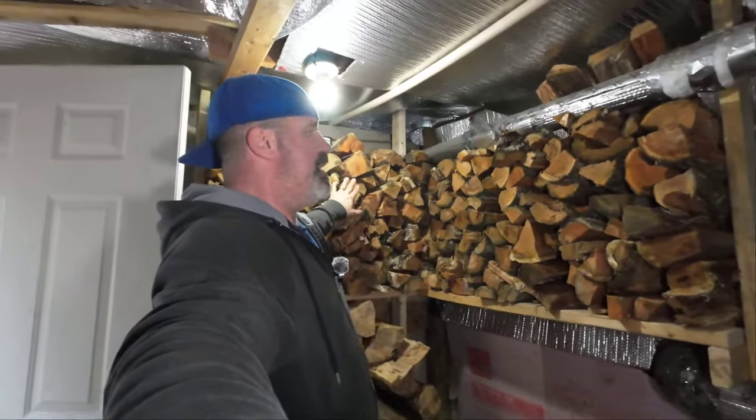They've made it quite clear. Even though this thing has a full foundation under it, it's still considered a manufactured home, and having a wood burner in a manufactured home in Ohio is very problematic. My insurance would go up probably about three grand a year — maybe more — if this was inside the house. So while it's inefficient, I think it's a good baseline. In the future, we are going to use mini splits powered by solar to offset the cost; this will be the backup. For cherry here, if I could dry a third of a cord from 30–40% down to about 15% in seven to ten days, you can see the value in that.